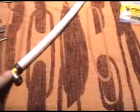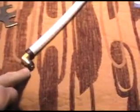It's not an actual elbow, but similar to this. Use these little brass fittings. You have to actually elbow it. You can't crimp it. The stuff will not bend real well at 90 degrees. So it's a fairly rigid product, so you'll have to use these.